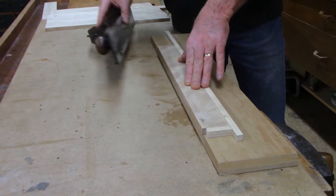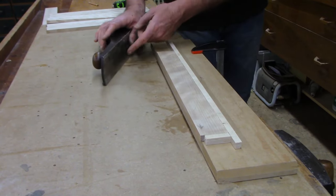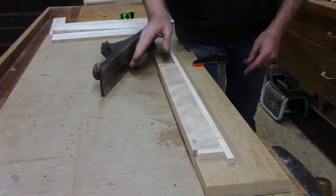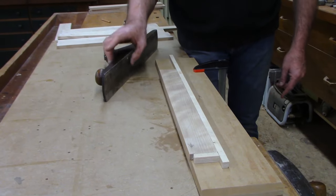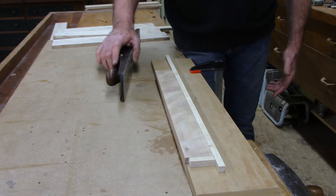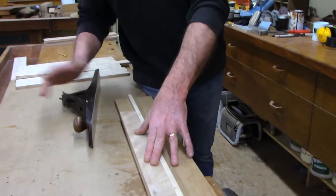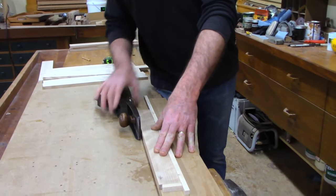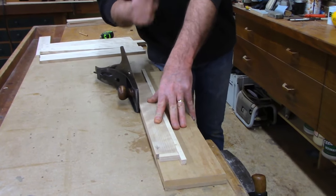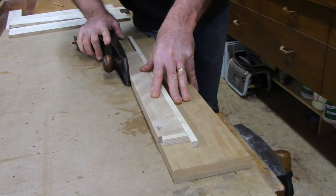You can take, like, this is my long joiner plane, which doesn't come down much. I would use this because when I sharpen this, I keep it really straight. I don't have a camber on that blade, because it's a joiner. So this is perfect for this. Also, the miter plane I have gives a flat shot. But it doesn't even matter if it's dead square on this corner, because you're going to get that same canceling effect I showed you at the joiner. So you'd get it on here like this, and get it positioned here.